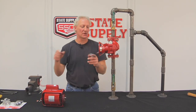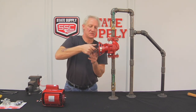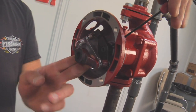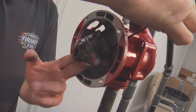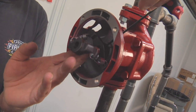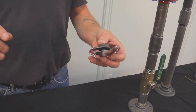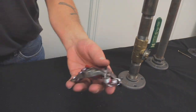We've got the motor on the bench. Now we're going to remove the coupler from the bearing side. We'll bring our Allen wrench in through one of the little breather holes in the side, get it right into that set screw, and give it a good twist — you'll hear it pop. We'll back out the set screw until it drops right out. Now if it's not broken or cracked, save it as a spare. That way if your new one breaks, you can throw this on and you'll have heat.